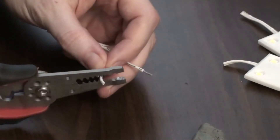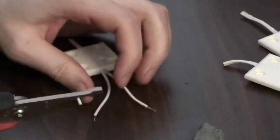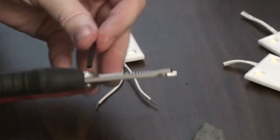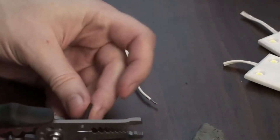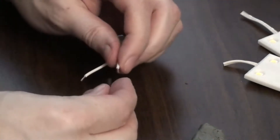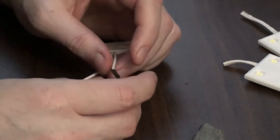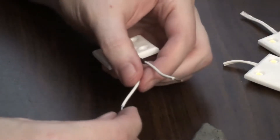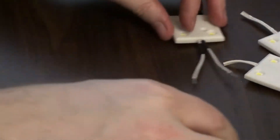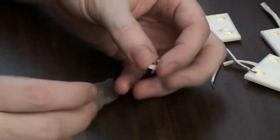These are little modules with four or five LEDs in them, and they're very, very bright. They can basically work as drop-in replacements for the tubes, though it takes a little bit of doing to make that happen — I have to do some soldering and wiring. Those two wires connect to a plug in each panel that plugs into the CCFL system. I found the appropriate size of header which I need to solder onto the wire to make it a connector, to just drop in and replace.